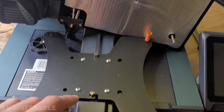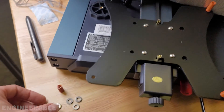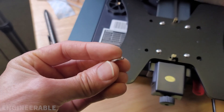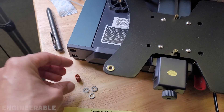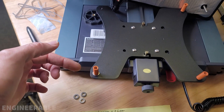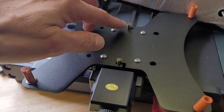My solution to prevent the brass pieces from ever pushing into the foam — no matter how tight the springs are — is to add 1.5mm tall washers on the base below the springs. That way I can bring the build plate down quite tight without worrying about it running into the belt ends.